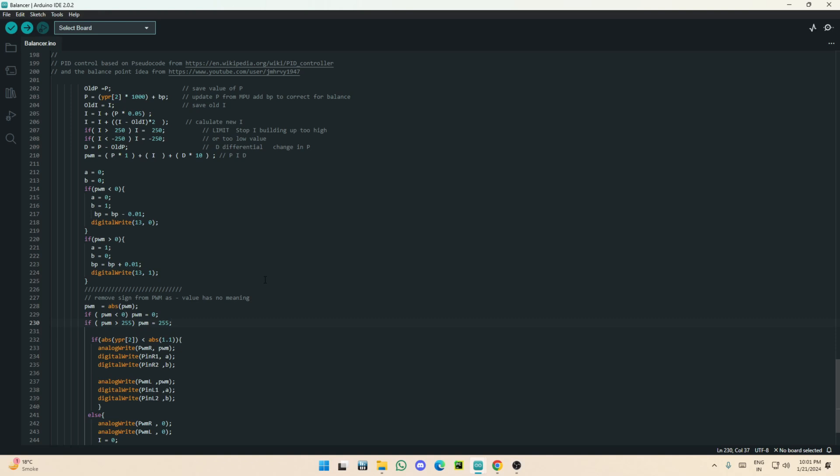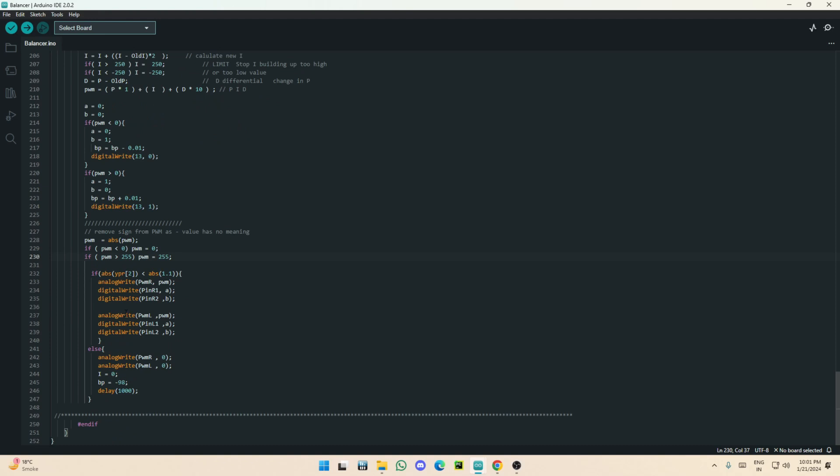The shaking is because my battery is mounted with velcro tape. Velcro is great for adjustability but if it gets loose, the CG itself moves forward and backward. That oscillation combines with the car's own oscillation, creating a resonance that causes vigorous vibration. The fix is just to press the battery down so it adheres better and prevents those oscillations.